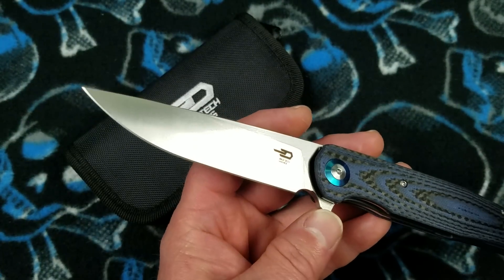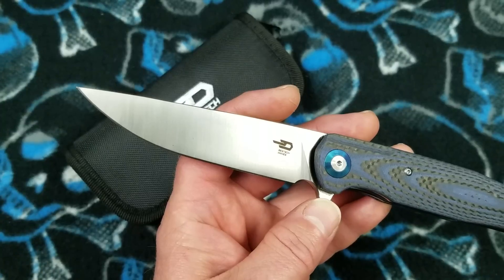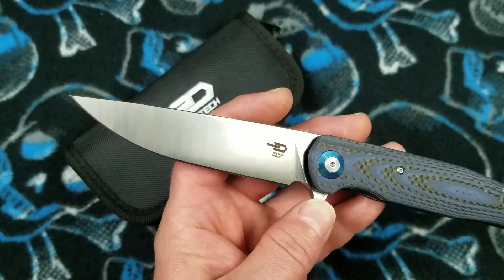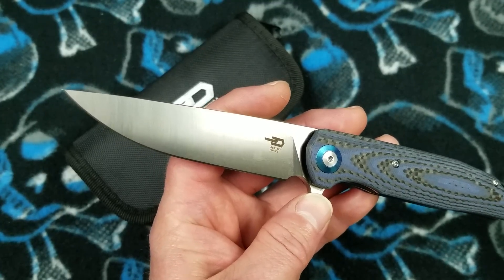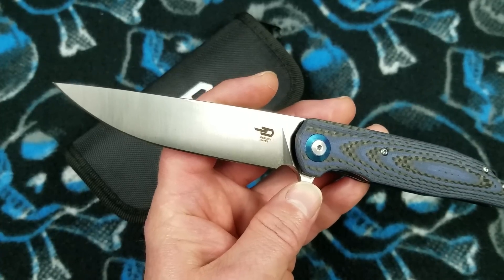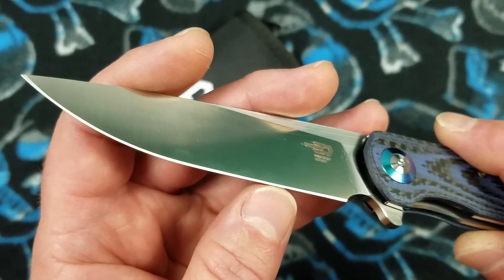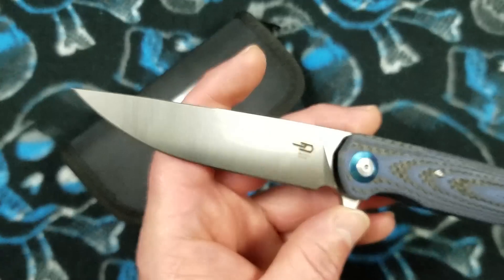D2 is a very good steel. You get very good edge retention — it'll take a toothy razor edge with very respectable retention. But when you break that razor edge down and get into a working edge, that's where D2 comes into its own. It will hold a working edge for a long time because it is packed with vanadium and has plenty of carbon. Those two combine to form carbides — ultra hard particles within the matrix of the steel. Under a microscope you'd see big vanadium carbides in a saw-tooth pattern at the microscopic level, and that's the reason it has such good working edge retention.